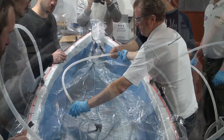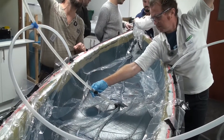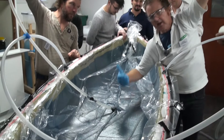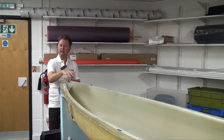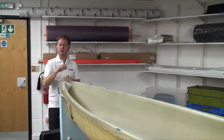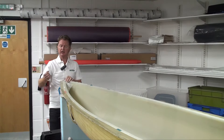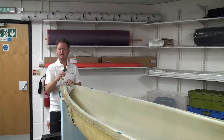The progress of the resin front is continually monitored and more mixed epoxy is added to the bucket as necessary — totals can be calculated in advance. Once the epoxy has reached the edge of the gunnel, the pipe is pulled from the reservoir and the last amount in the tube is driven into the mould. It's necessary to run the vacuum for a minimum of two hours on a part like this; on much larger parts you'd want to draw the vacuum overnight to ensure all atmospheric air is purged from inside the laminate stack.